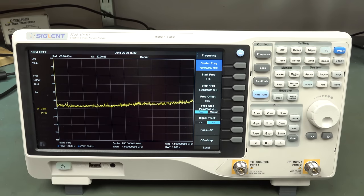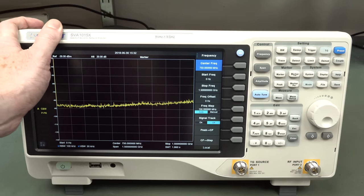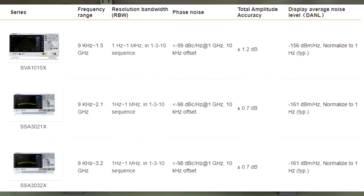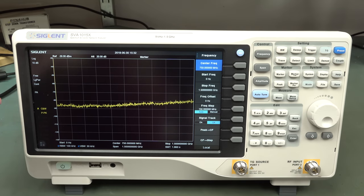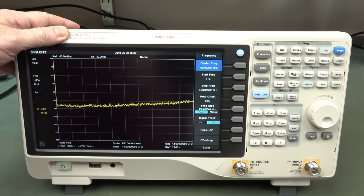Compared to the SSA-3000, the phase noise of this thing is practically identical. But the noise floor isn't as good - this is minus 156 dBm compared to minus 161 dBm for the 3000 model. So it's got better hardware in the 3000. I'll link my teardown below for the previous 3000 version - I think that's an absolutely brilliant teardown, because I took high-res photos and did all the voiceover and editing with block diagrams.